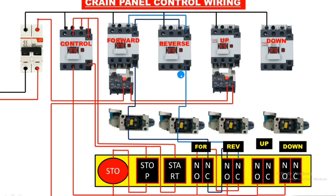Same operation for up and down. For up operation: when the up push button is pressed, first connect this supply into the down push button NC terminal for interlocking. Output of NC connects to the limit switch which stops the up position. Output of this NC connects to the down contactor NC terminal for interlocking, and the output connects to the up contactor coil A2 terminal, so the up contactor operates. For down operation: when the down push button is pressed, first connect into the up push button NC terminal. Output connects to the limit switch which stops the down contactor. Then connect to the up contactor NC terminal for interlocking, and output connects to the down contactor coil.